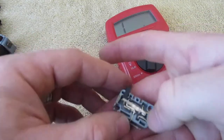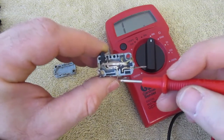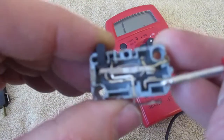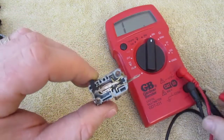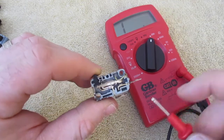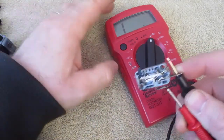Here's the cap, and as you can see there are three little prongs here, and it just slides into place. Here is virtually the whole inner workings of the micro switch. Here's one of the leads, and what happens is power comes up through here. You can see there's a little space at the tip there. Because there's a space there, when electricity is coming through here we cannot get power to hop to the other terminal. That's why when we put the two leads in, we're not getting any reading.